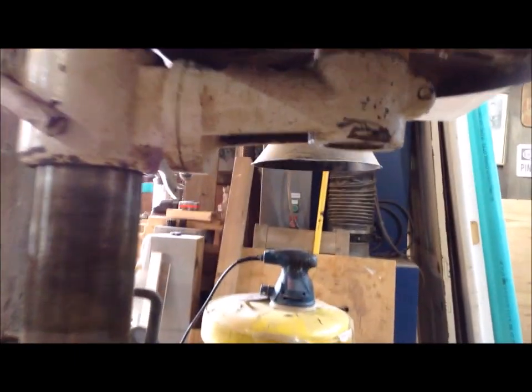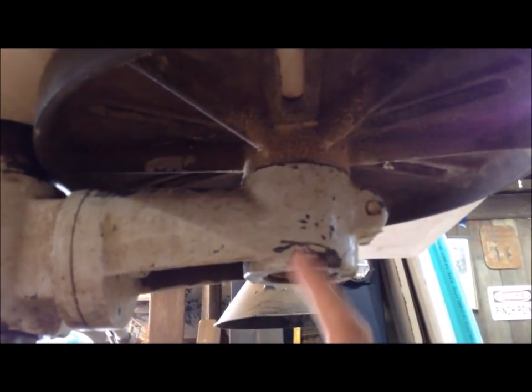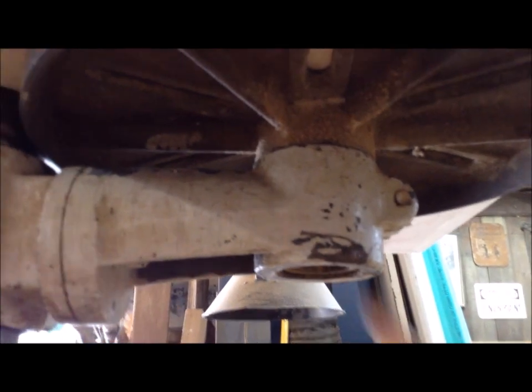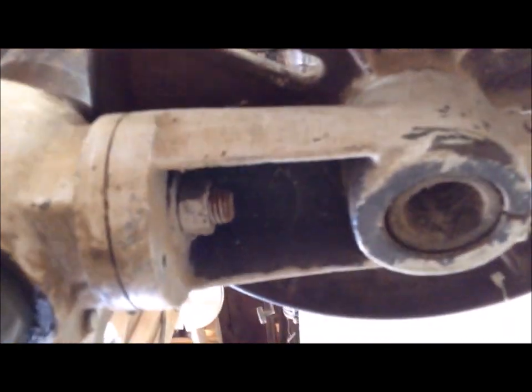I aligned this so my two vertical holes go center through my point, and the X-mark comes off at even spacing. I marked the center of both holes so that if I want, I can undo the knob holding this in place, slide it forward, and my two marks will line up in those new holes. That way I can slide the whole thing along the T-track.